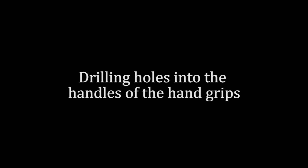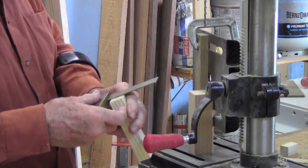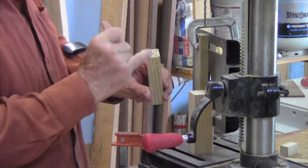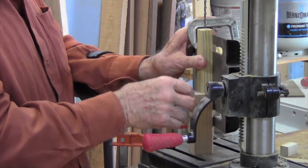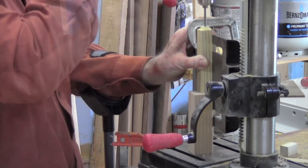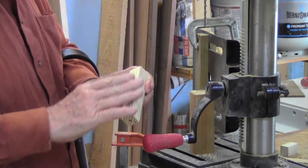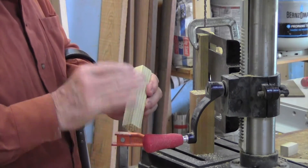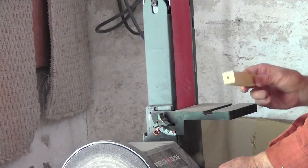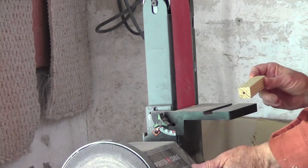So here we are — this is drilling the holes in the handles for the hand grips. Take them in with a square, mark the center line so you know exactly where the center is, take the X in the middle, put that marked corner in the corner here, and hold it in place. This will be carved down to be a cylinder over which we're going to slip the hand grip. Now we're going to shape the hand grip piece — it's square stock — and we're going to knock off the corners so that we can fit the PVC vinyl hand grip over the top.